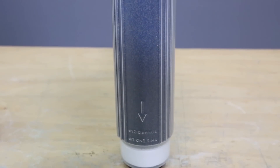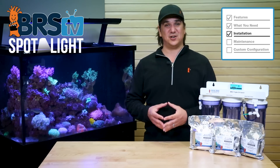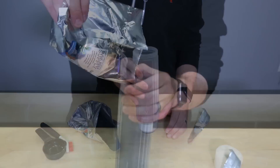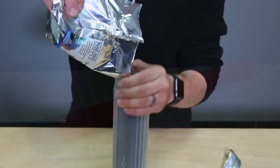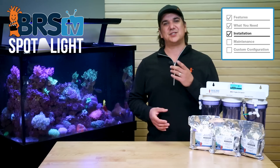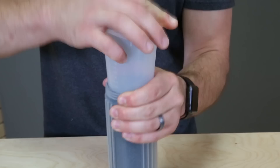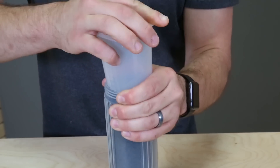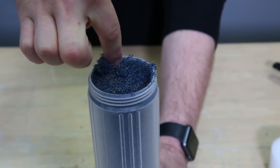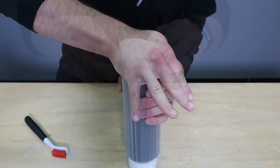If you are going Pro Series resins you probably already know how to pack a DI resin cartridge, but as a quick refresher: fill it about a third of the way, tap it 10 to 20 times to settle it out, fill it another third, and repeat till full. At the top, use a tool to pack it in solid — this can be a PVC pipe with a cap or something as simple as a bottle, like a 250ml measuring cup. Once it is full, scoop out a tiny amount with your finger to keep most of the resin out of the threads, add the foam ring, and screw on the cap.